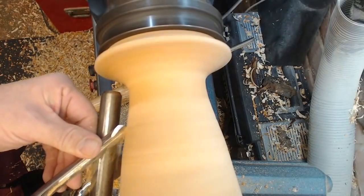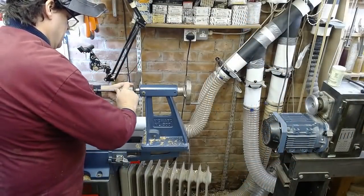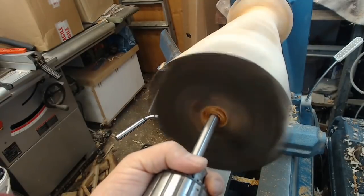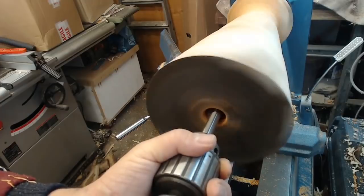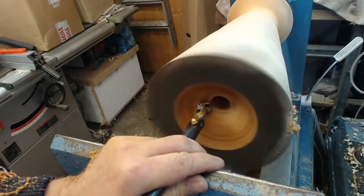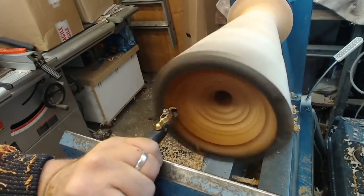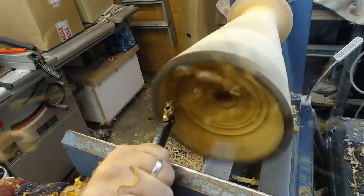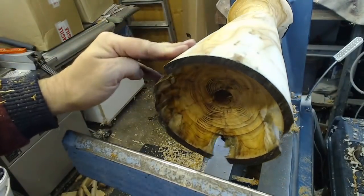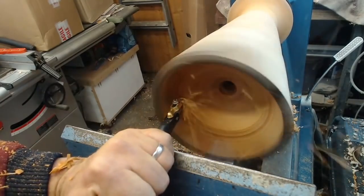Using a smaller gouge here — this is Bledsthorne's signature spindle gouge — just a little bit more finessed with that tool, which cleaned up that torn grain. I decided to put the sanding off for a while. So here we are drilling out with a one-inch Forstner bit in a Jacob's chuck in the tailstock, just to get me started with the hollowing. The hollowing tool I mostly used is the Proform from Woodcut — it removes wood brilliantly. It comes with a metal handle with quite a bit of weight on it, but I was getting so deep eventually that I had to add another handle: a Simon Hope long handle with the red collet chuck, which fitted perfectly onto the end of the Woodcut handle.